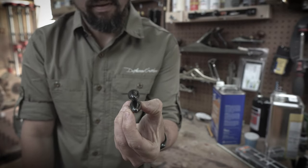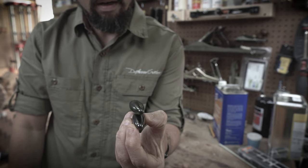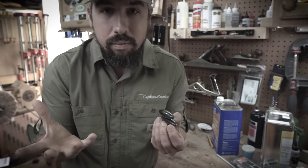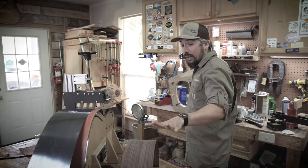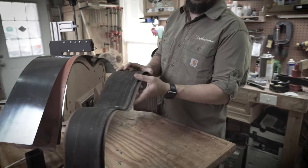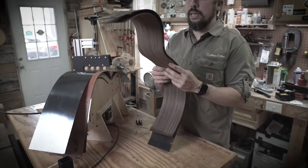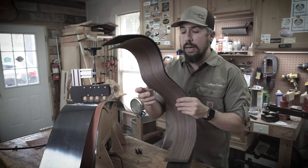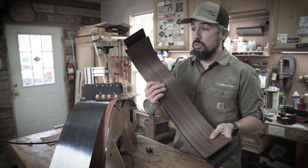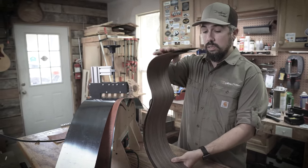Let's imagine I tightly grip the sides. It's like 10 times the amount of time that it's vibrating, and to me that was just like holy cow. Now that we have that Indian rosewood all bent up, you can see how it's going to fit together nicely with the exterior wood. We're actually going to laminate these together by putting them inside of a vacuum bag. You're going to be amazed in the next episode when I do that — how much less play there is on this.